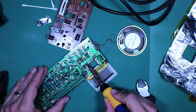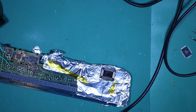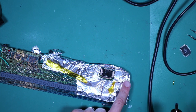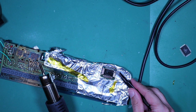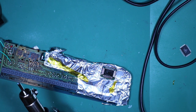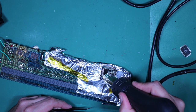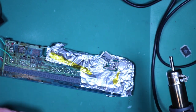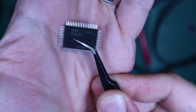Having cleaned up those pads, I'm now going to remove the chip from the PT-10 — the same removal process, except this time I'm not as worried about surrounding components since I don't intend to preserve that board. I've put a little bit of flux on this time in the hope that it helps the removal process, and I'm going to be more attentive to the status of the solder so I can get the chip off sooner. Note that the original audio for this portion was crackly so this section uses a different voiceover recording.